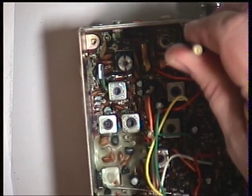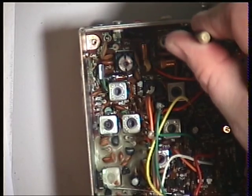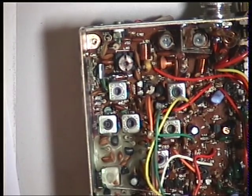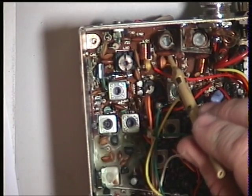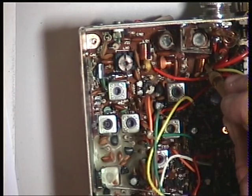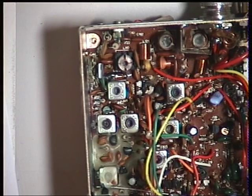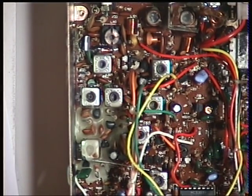And then finally L115, which is in that screen plate there just where the aerial socket is. The radio will go well beyond 4 watts, and we've now set it at 4. I'll just seal those back up so they're nice and neat. If you're struggling to get 4 watts, you can expand or contract coil L112, and you can expand or contract coil L113 — that's what it says in the book. So I'm happy that's doing the proper power.